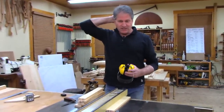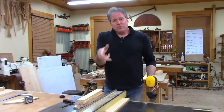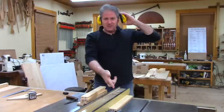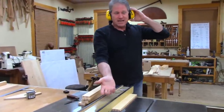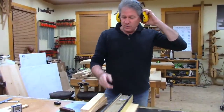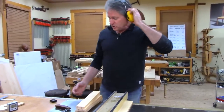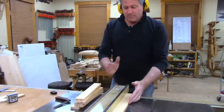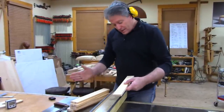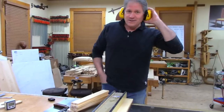Okay. Yeah, you would have to set up a shooting board, Dean, that would pivot, because you'd have to hold your hand plane at exactly whatever degree you wanted. It's not really necessary when you have tilting table saws. This is what it really shines at for this kind of thing, and the tilting fence on the jointer. But once you've established the angle, you can then clean up that surface with a hand plane by just holding it flat and true on whatever that surface is. And that's what we'll do in a minute. All right, so I'm going to go ahead and rip these. I'm going to keep the face up the whole time. Then I'm going to turn it around, move my fence over and rip them again. And then I'll come back to you. Here we go.